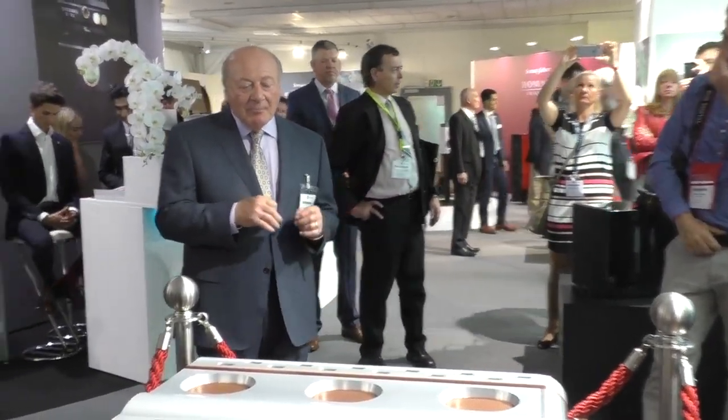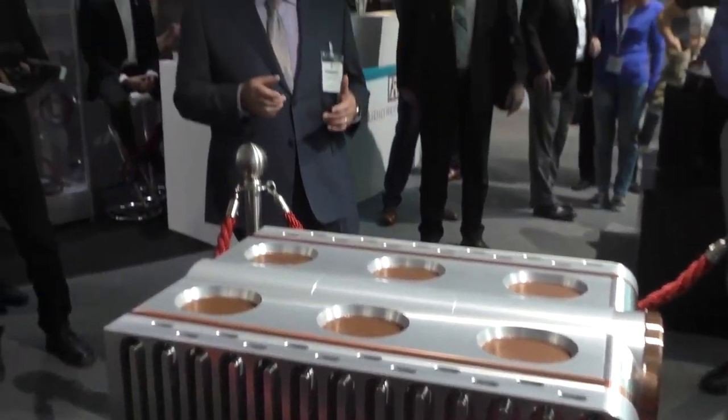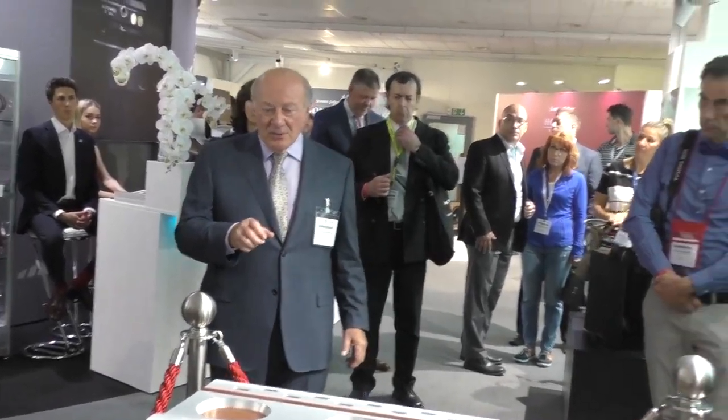It's got an amazing lightness and musical quality that's never ending. It has over 100 watts of Class A at idle, so all the low-level signals are never lost. It could also be run on almost any kind of household current. I'm telling you, you're not going to put 6,000 watts into 2 ohms with 110 volts, but it will turn on and it will play perfectly fine. It won't dim your lights. It's got a very special soft start circuit in it.